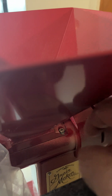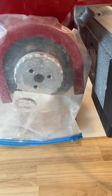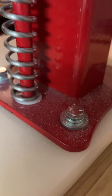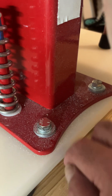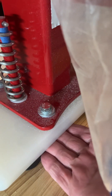It should be all the way in. I'm happy with the motor. They wanted to know how I did the mounting — I bought a one-inch thick cutting board from Amazon, probably around 12 by 18 inch, and I got some rubber feet and measured and spaced them out perfectly underneath. I put the grain mill on top, decided exactly where I wanted it, marked the holes with a black marker, drilled them with the proper size drill bit, tapped right into the plastic, and it's bolted right down. There are no nuts and bolts underneath.